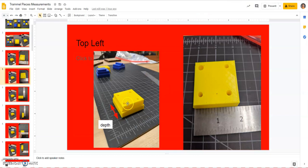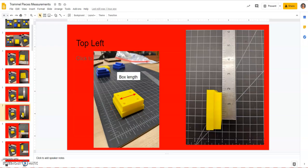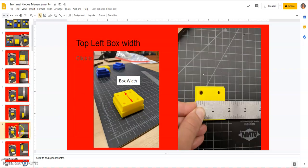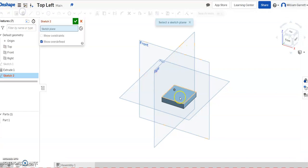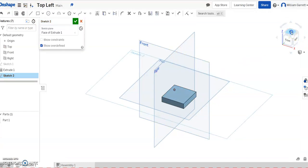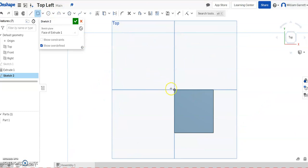I'm going to create this in the same orientation as the ISO view, starting my next level in the back corner and extruding it upwards. I'll sketch on top of the surface I already have — it's got a length of 1 and 3/4 and a width of 1 and 3/4, so it's going to be a square on top. I'll come back, do my sketch, put it on top, turn to the top view, and do a rectangle.